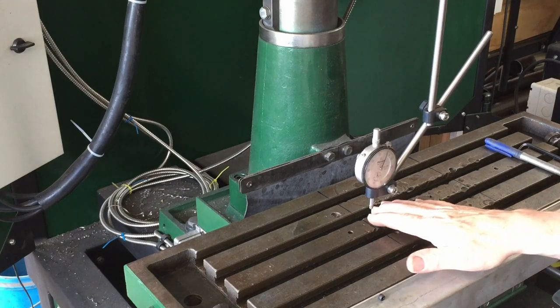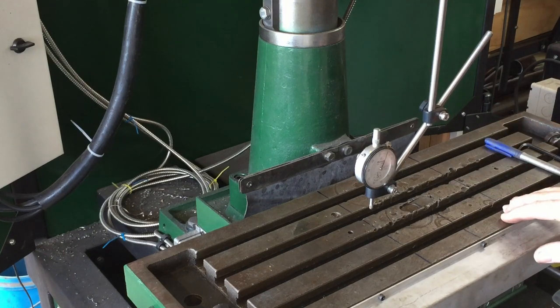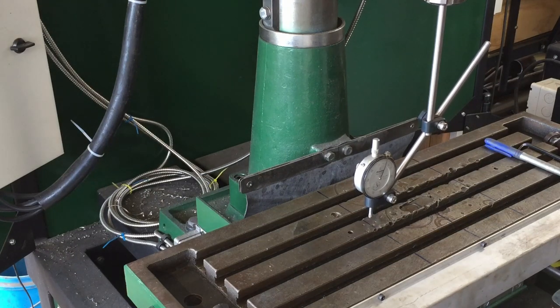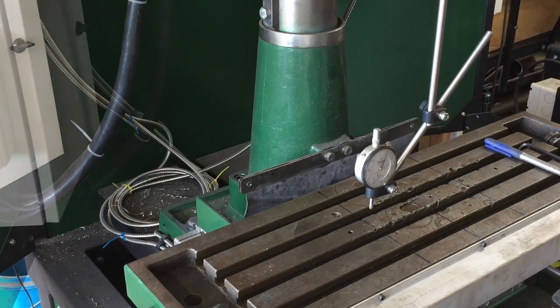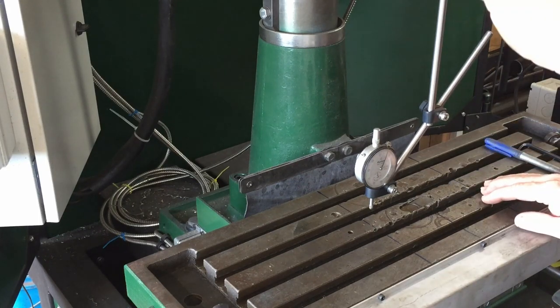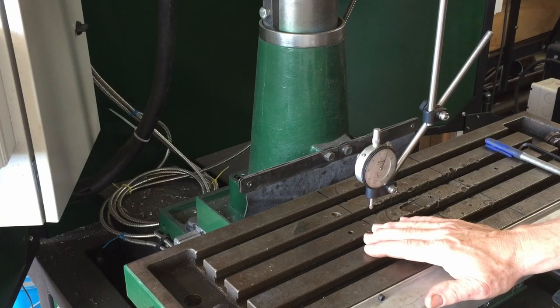With this dial gauge you have to hold it up as you turn it around since you can't lift it from the top. So what I'm going to do is use the dial indicator just as a touch-off - when it just starts to move I know I've touched the table - and then use the DRO to tell me the difference between this end and the other end. I know the high spot is on the right-hand side, so I'll touch off, zero the DRO on the Z axis, come back around, touch off on the left-hand side, and that should give me a pretty accurate reading of how far we're out.